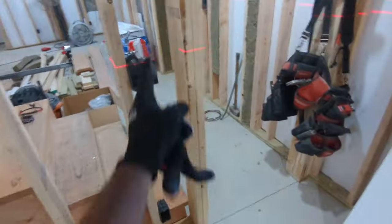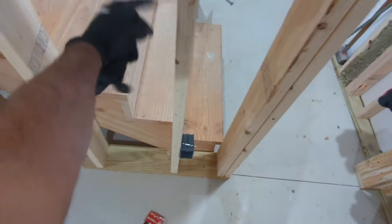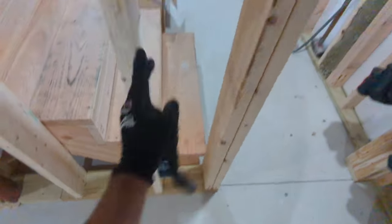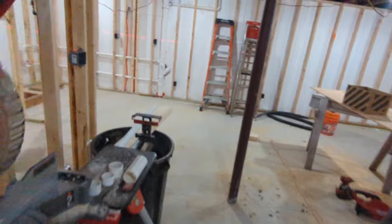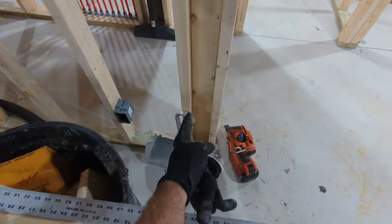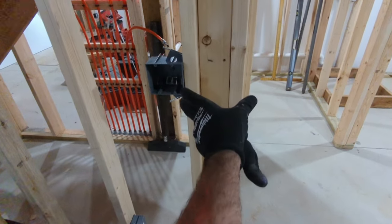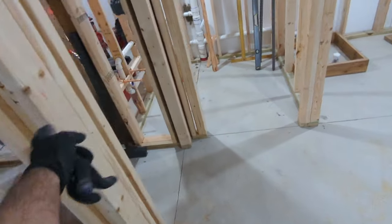But right-hand side again. And right here, we're in the same bay. So we're not going to have to come through just to have an outlet here. It makes for another hole to drill. So things like that where we're going to be smart about it. In this case, it's in the same bay, but they're on either side, just because that would be too tight to the corner. That's getting to be ridiculous. You want to pay attention to what you have for white space here. This is a little bit tight, although this is an outside drywall, so that's fine there.